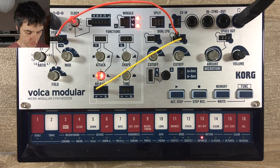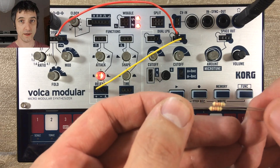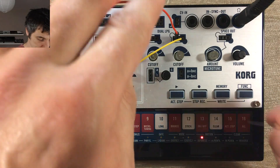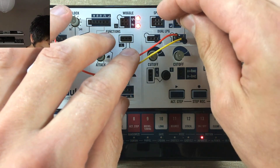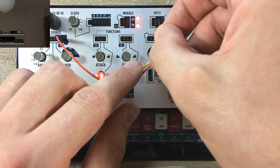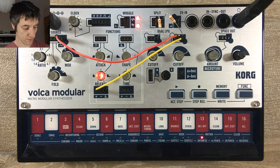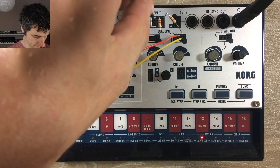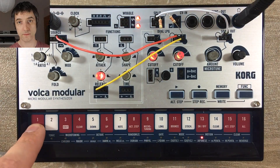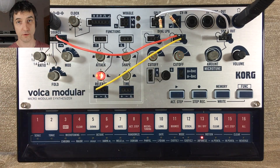What we need to do is grab a couple of resistors — these are just the first ones I laid my hands on, they are 2.2K. Different sizes will probably work, but I haven't tried them. Using a split from the right-hand side into the top-right connection and the same into the top-middle connection, we're mixing those two signals together. We then take the output from the top-left connection and run that into our output. Suddenly we've got the same sound, but no distortion — both oscillators mixed together.